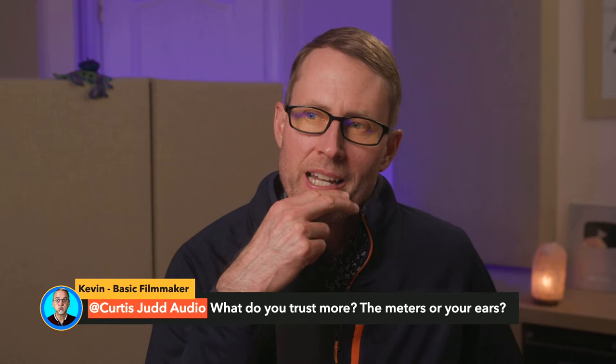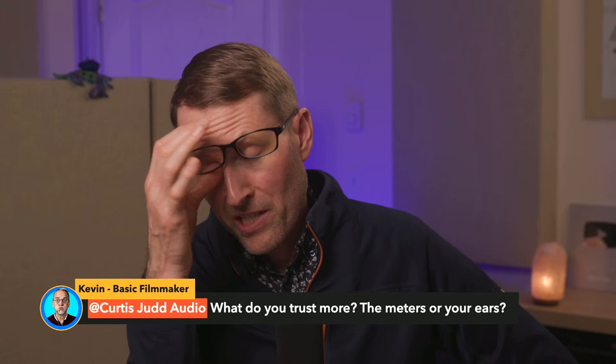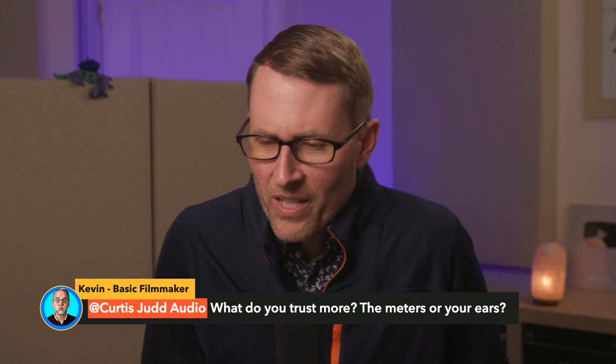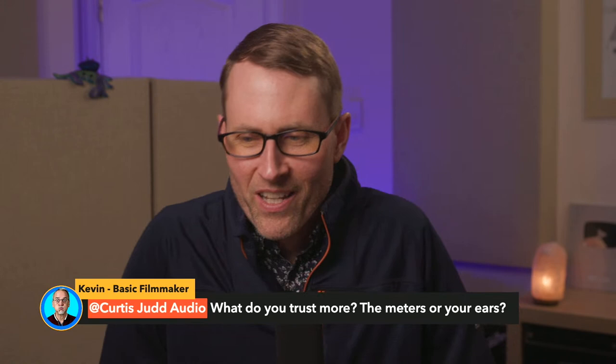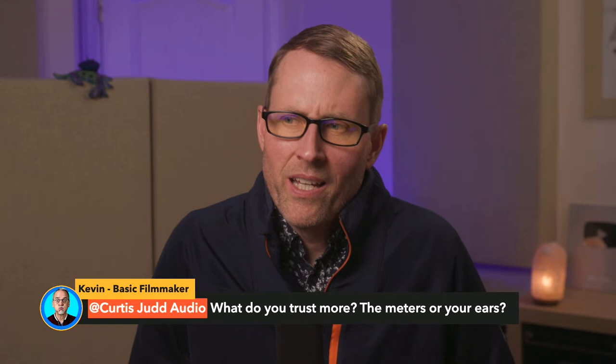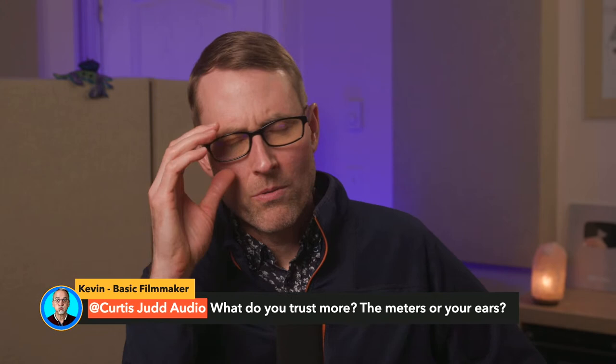You can actually get up to 0 dB full scale and not necessarily hear a whole lot of distortion if it only happens periodically. You should avoid it, of course, but we were working on a live stream at work this last week, and one of our guests was running a little hot. Before we pulled them down, they pulled their levels down, I should say. They did clip a couple of times, although audibly it happened so quickly, and for just a limited number of samples, that it wasn't super obvious, but we were able to get on top of that.